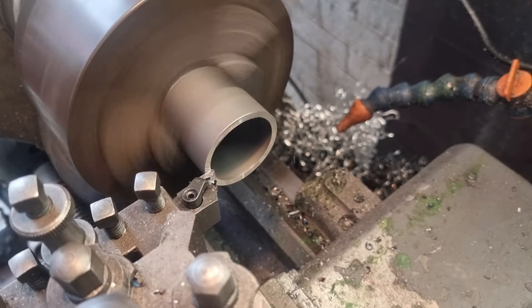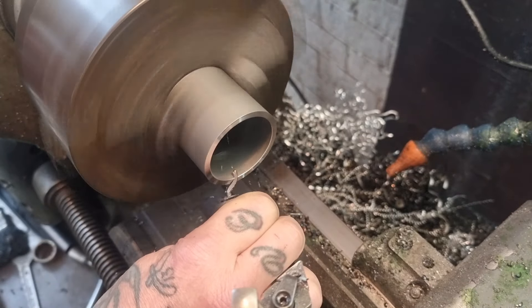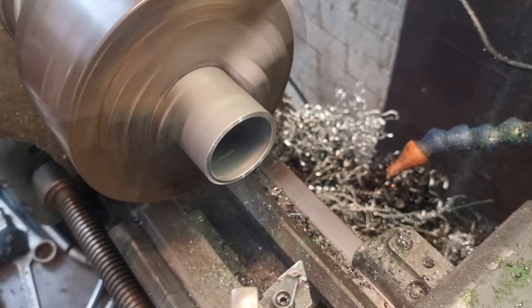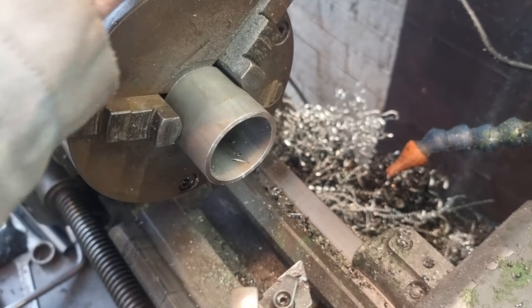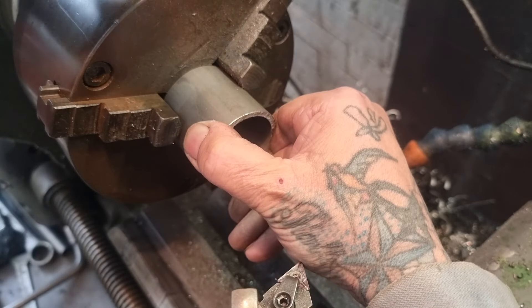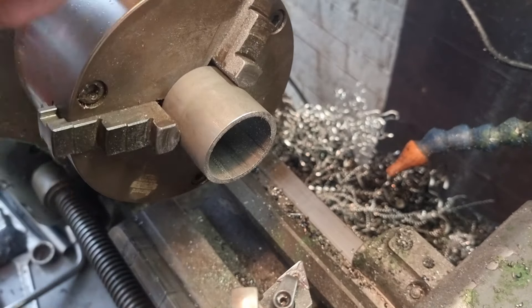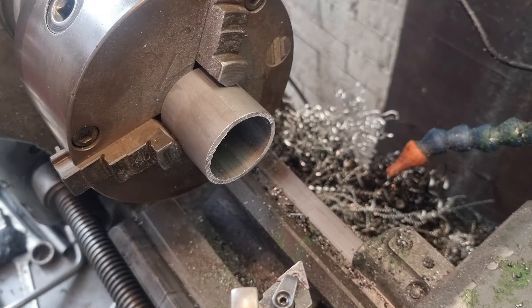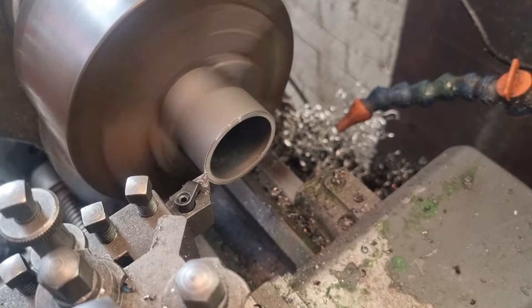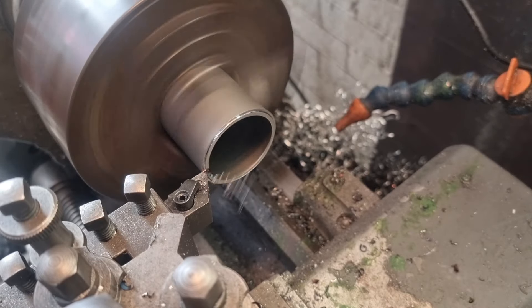We'll get that smooth, like so. Just check that we've caught it all. Break that edge. Now we've touched the tool off on the face of the chuck and zeroed the readout, so when we place that in there up to the chuck and face it — could be happy days. It should be running true, but it looks like it's shaking like a shitting dog because of the sawed end. Anyway, we can move it all in to 45mm. We can turn this down until we get to minus 45mm, which will be coming up in a minute. Come on up — here we go, 44.4. 44.2 — we'll take that.